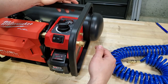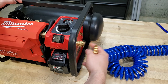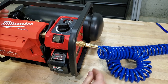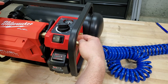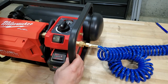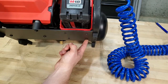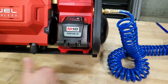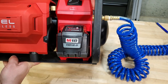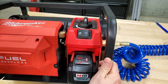One thing I really don't like about this design is how much lateral play it has when you're connecting the hose. If you've got pressure in it, you have to push sideways quite a bit to connect the quick disconnect. To combat that, just don't have it at pressure when connecting — turn the regulator way down and plug it in without much force. The plastic housing is only connected by four screws with nothing structural, so there's a ton of play when you push it sideways.